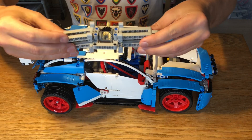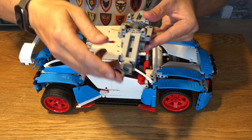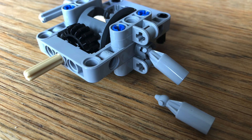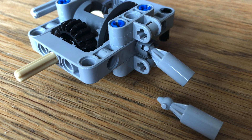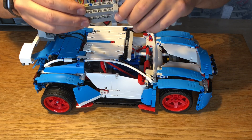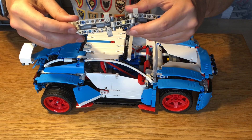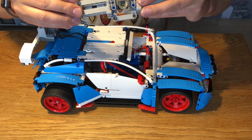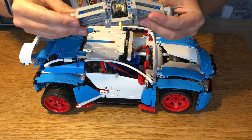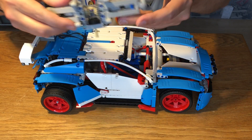Normally you have this kind of component in the back which you can add a motor to, and then it will drive the wheels. The problem is that these little pins used to transmit the force are so tiny that they break very quickly — it's not really useful for any serious play or driving around. It's an elegant and beautiful solution, but drive around with this for more than half an hour and you'll find the little pins will have broken.